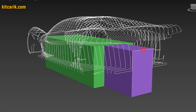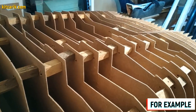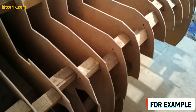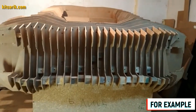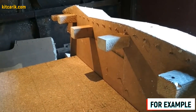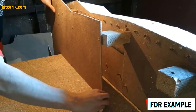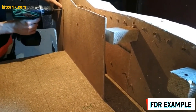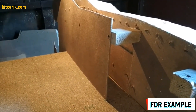To assemble the car buck, we need wooden blocks sized nine and a half centimeters and four and a half centimeters. The fiberboard sheets are five millimeters thick, and the space between main body sections at a step of ten centimeters equals nine and a half centimeters. The same logic applies to the four-and-a-half centimeter blocks for front and rear sections. The fiberboard sections are numbered so we don't get confused during assembly. We put the mirror halves of each section together to form the whole section, fasten them, and continue strengthening subsequent sections with nine-and-a-half centimeter cubes, one line after another.